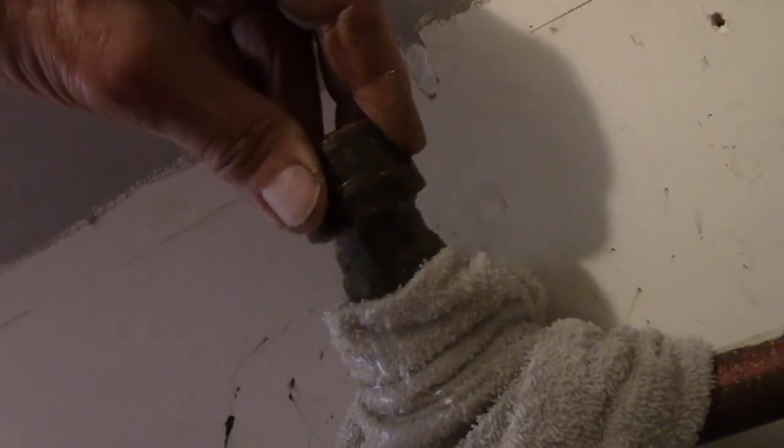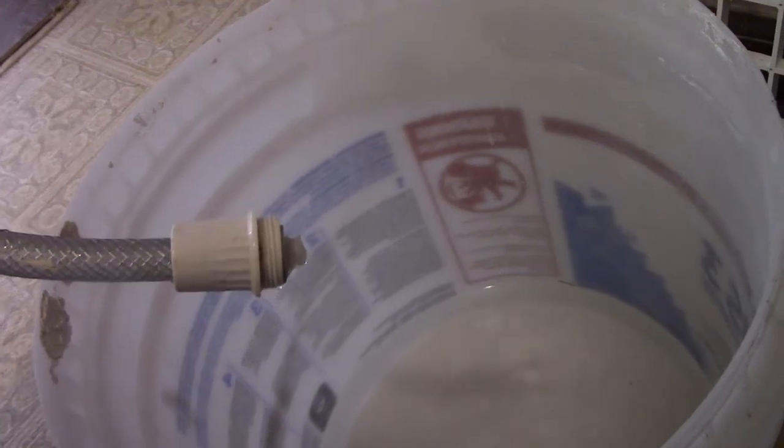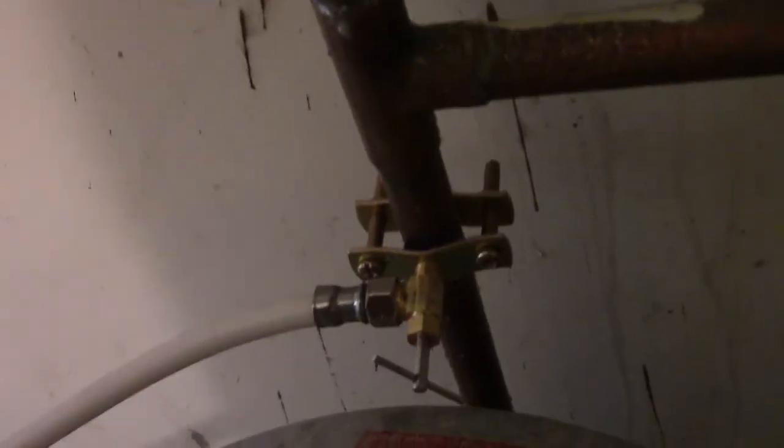So there's pressure here, which doesn't surprise me. What makes me unhappy is it's really not coming out here, which I could drain easily into that bucket. That saddle valve isn't working right — probably the rubber's messed up. If I release the screw a little bit... the other thing that worries me is if that other one's not working right either.